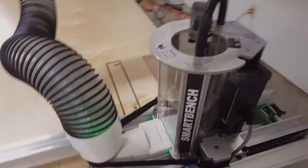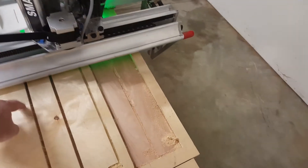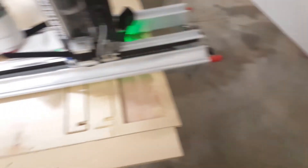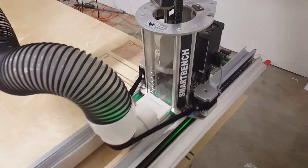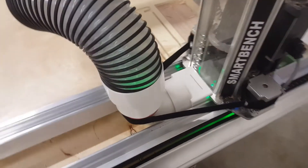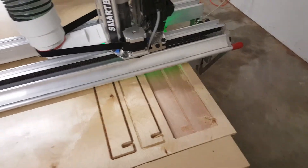I adjusted the material thickness closer to the 0.465 that it actually is. Same exact setup — I just copied it over and moved it, and I did spread them a little further apart. But the tabs are on the outside, not the inside, and this one held. It's a loud bit because it's a straight cutter, but it's doing a great job — nice and clean. The pickup from the dust collector I really like. I hate cleaning up the floor. This is a nice, inexpensive little upgrade. I'm going to test it and see how it does, and if it needs any modifications I'll let you know.